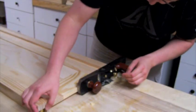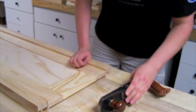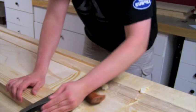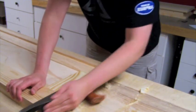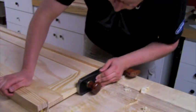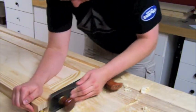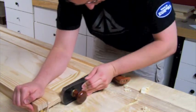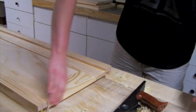Now I'm ready to assemble the carcass. I found a section of panel that was slightly proud of the legs, so securing it in place on my bench and using the bench top as a makeshift shooting board, I went ahead and leveled the top of the panel with the side posts. It worked out really nicely — a flush, perfectly jointed, and flat surface that the top will register against once I've got the whole carcass assembled.